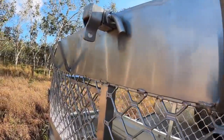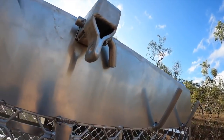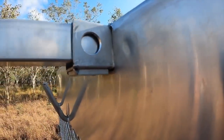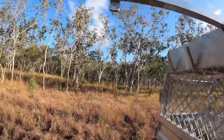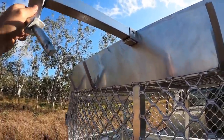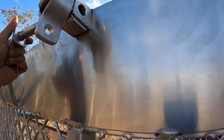It's got four pins across there — I'll see how they go. I'm going to put R pins through these, similar to what's through this, but a bit heavier duty. This is also a way bar, so if you pull that out, pull it out to get to the next hole, line it back in, put your lift lock on there, away you go. It should lift a couple hundred kilos, it's pretty strong. The only thing we're going to improve is stick a wing nut in there so you can tighten it up and stop any rattles.